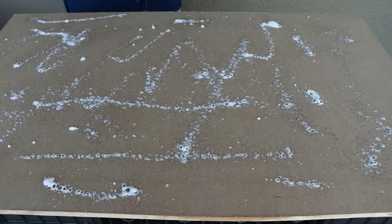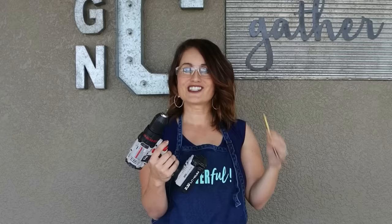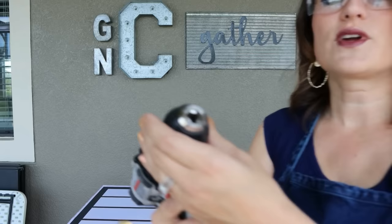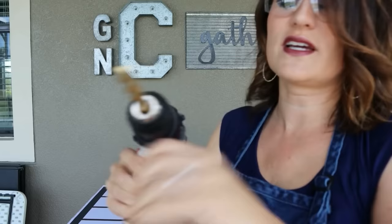I spray the glue onto the wood, let it get tacky for about 30 seconds, then smooth out the bubbles — it's stuck down pretty good. With the breeze going on, this won't be flying everywhere. We start by switching to a drill bit to drill a pilot hole for the saw blade to fit through. Loosen it up, pull it out, make sure the hole is fully open, stick the bit in, pull the trigger, tighten it up, and we're ready to drill pilot holes.